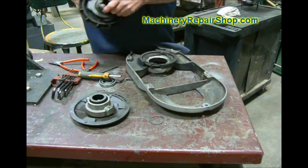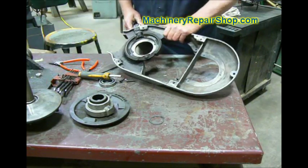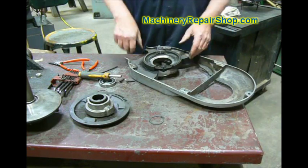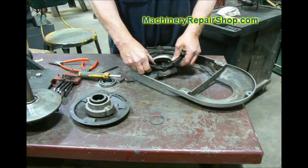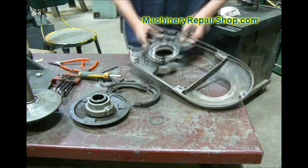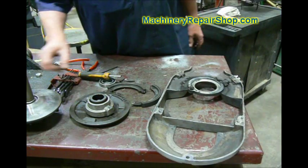You can see on the pulley assembly, this is the brake drum here, and here are the brake shoes. It's pretty simple — it's a little cam that just expands the brake shoes. It's completely over-engineered; they rarely get worn out. I'll take the brake shoes off right now — simply pull them against the springs. Don't lose those springs. And then that can go into the magic cleaning box.